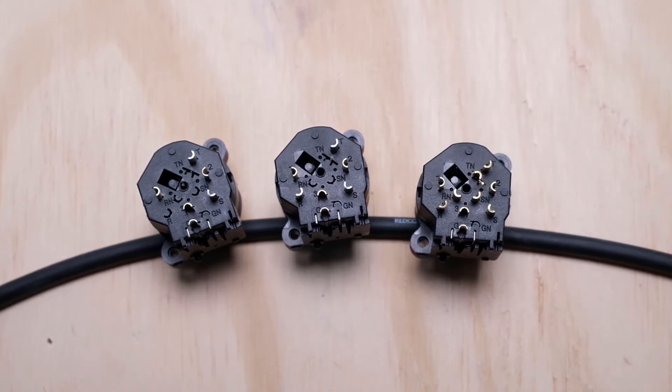Here's one practical example. A lot of audio interfaces have a few mic inputs on XLR connectors and additional quarter-inch line-level inputs. Say you have four of each. You could take four combo connectors and wire eight different cables to the back — two per combo connector. Four cables terminate in male XLRs and the other four in male quarter-inch or TRS plugs. This keeps your input panel smaller and lets you optimize cabling between your mic and line-level inputs.